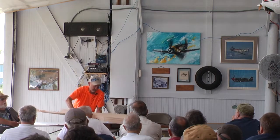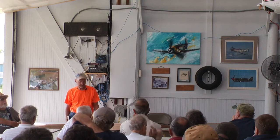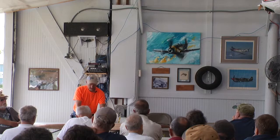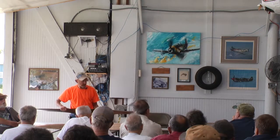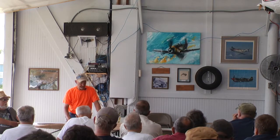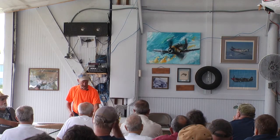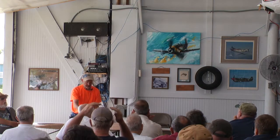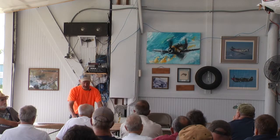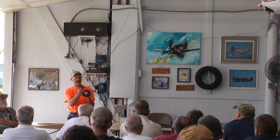You need a pretty accurate drill press. At least that's the way I did it. Put the carved prop on your drill press bed. Clamp the crush plate in the proper position and make sure it's not going to move. I used C-clamps and whatnot. Made sure everything was clamped down so it wasn't going to move, and then I just used the crush plate for a drill guide.